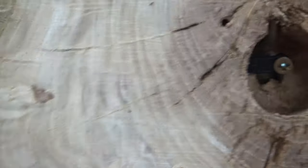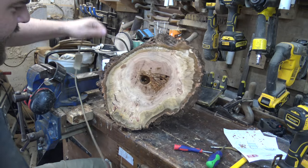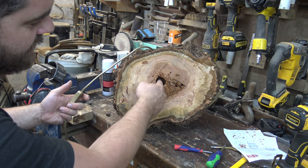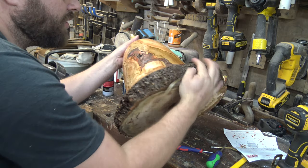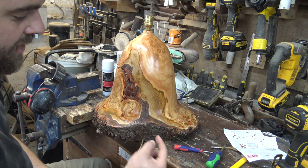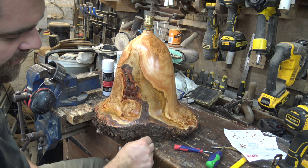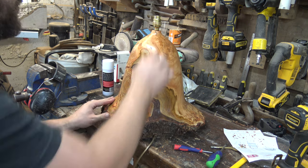Pull on that. It's rocking the base rather than pulling the electrics out. So see, it's nice and secure, pull on that. It'll take over 5 pounds of pressure, not pulling the light out, securely fixed in place there. What you can also do for extra security is put a little rubber grommet into where this hole's coming out, with some flanges that come off, like spikes, to hold that securely in place. So that's an extra line of security.